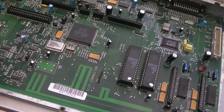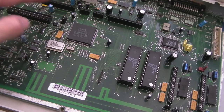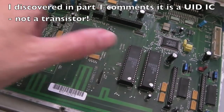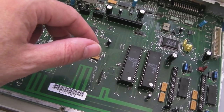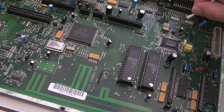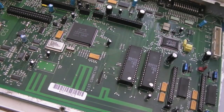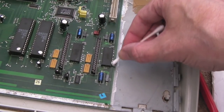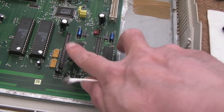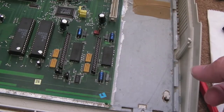Not really getting anywhere further with this. I've checked the obvious things like the jumpers, reseated them, compared them to the other board, swapped the socket transistor - made no difference, swapped the ROMs. There's a bit of corrosion on the SRAMs - just a little bit. There could be something broken around here or it could be faulty RAM. The next thing I'm going to do is get the board out so I can clean it up and inspect it super close on both sides. I've also cut off the battery - I don't want that on here - and that's made no difference whatsoever.